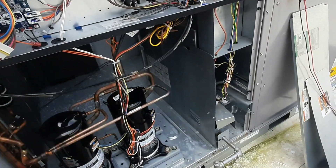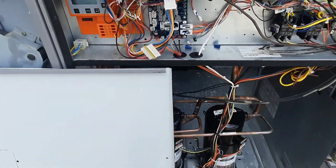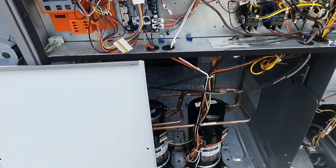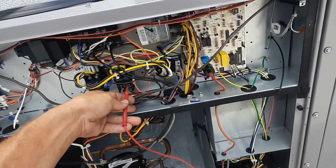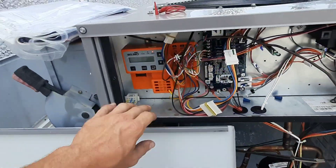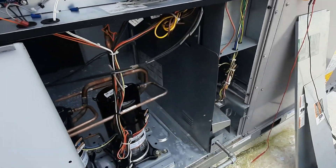I'm assuming the phasing is going to be correct, but we'll turn it on and we'll hear it if the compressor comes on. Return air sensor not detected, outdoor dry bulb - it's just showing me the alarms. Don't do that with a metal screwdriver. Phasing is correct.